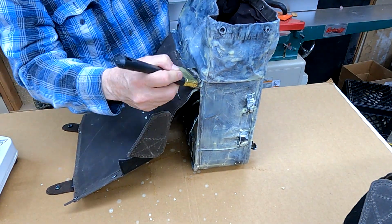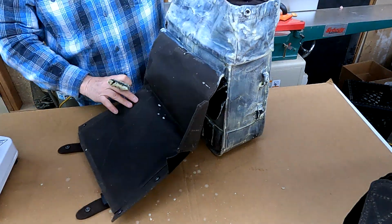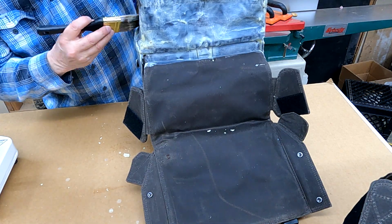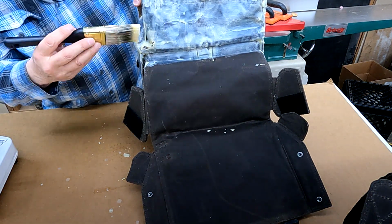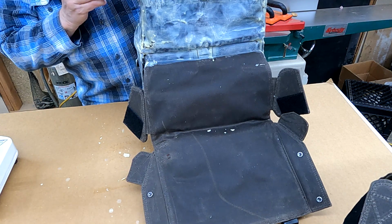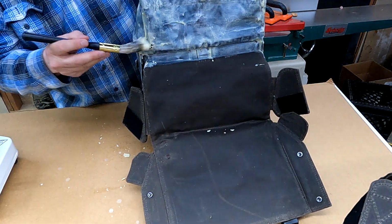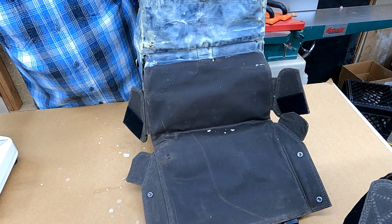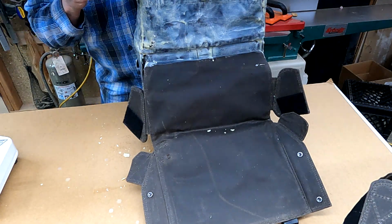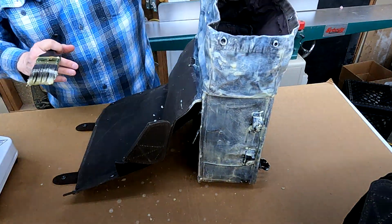The stuff that I bought from this gentleman, it's not highly filtered, it's not super clean. It's beeswax. And being in my woodworking, I use it quite a bit. I bought like 10 pounds off the guy, and it's awesome. I love using it on my cutting boards and utensils and things like that. I make a special batch of finish that I use for woodworking, and it's beeswax, mineral oil, and I add a little carnauba wax to it, and that just makes it a little harder, a little more long lasting on your utensils.